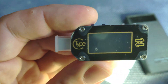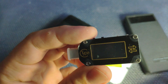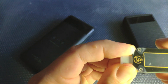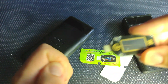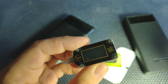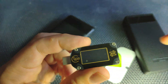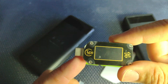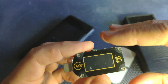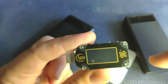What is nice about the newer model, the 66C, is that it has a bidirectional working mode. So you don't have a fixed input or output — it's just a plug on one side and another plug on the other side. You can either connect it to the power source on one side or use the power source on the other side as the output for your device, so it doesn't matter how you install this in your USB circuit.